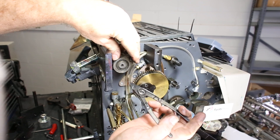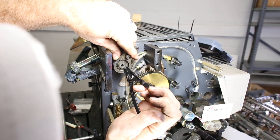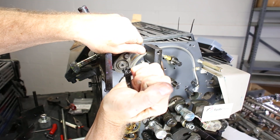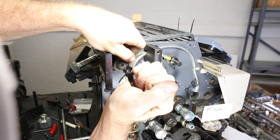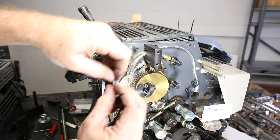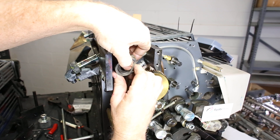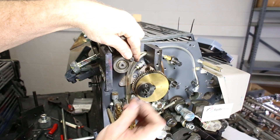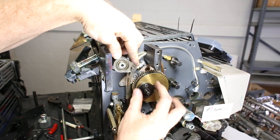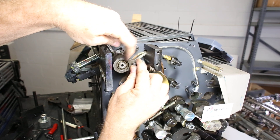With a pair of snap ring pliers, I'm going to squeeze and pull out on the hub at the same time. There's the snap ring, and this clutch will just come off. You can see what it does — it grips going one way and doesn't grip on the other. When this link ratchets back and forth, that's what drives the roller.